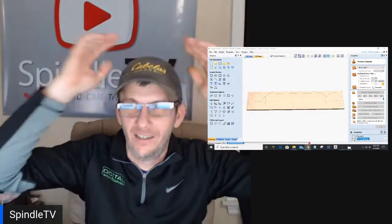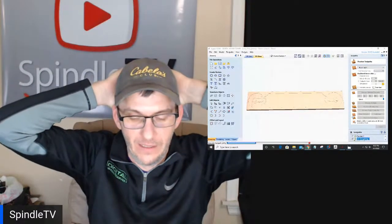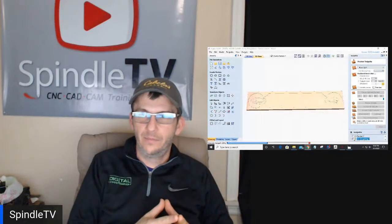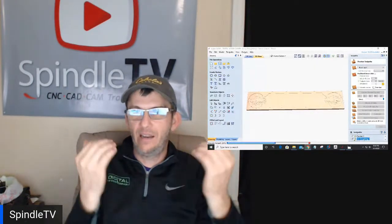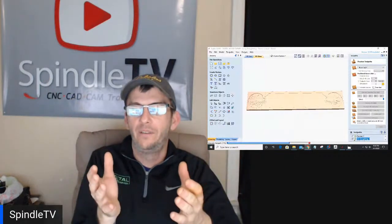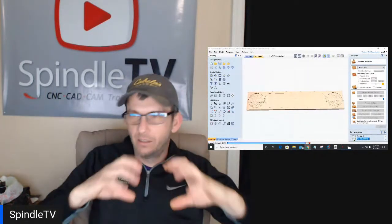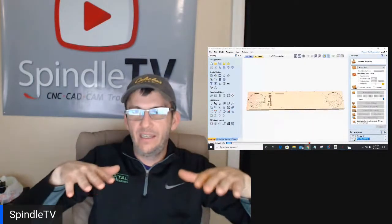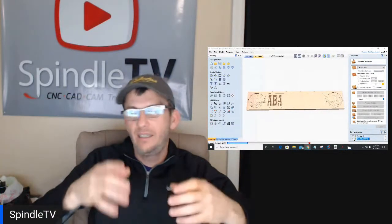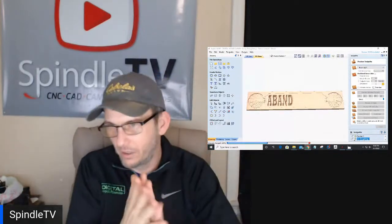So many screw-ups on the design and the explanation of that inlay. It's a very simple process. Basically, I do it with my inlay cutting boards and things where I create outlines. And you create your first inlay, filling in your male and female, get it all together, get it milled back down flat, so you have that inlay of that contrasting color. And then if I wanted to, I could do another inlay of a separate contrasting color in the middle of that, but I don't. I just want to V-carve and gild it.